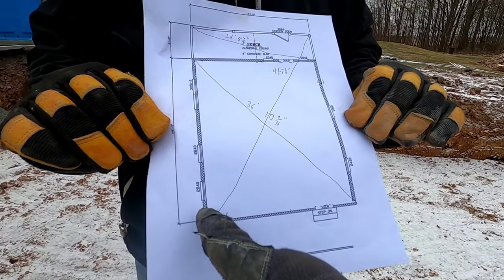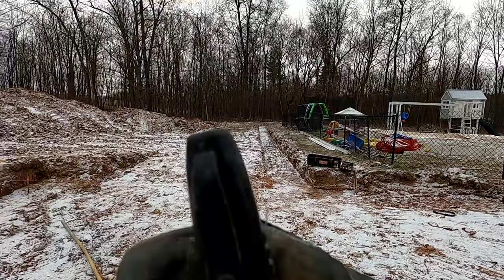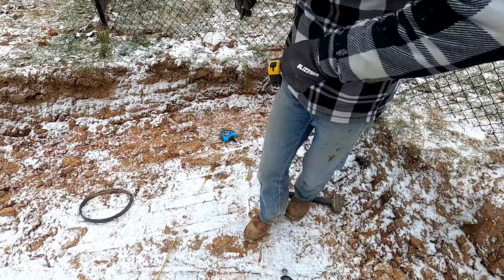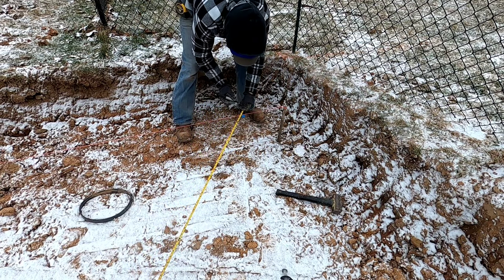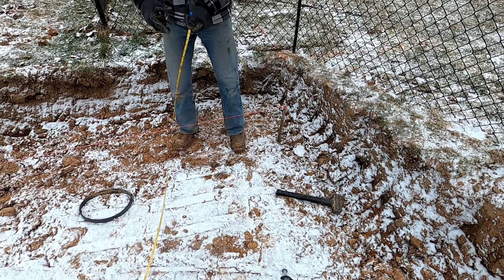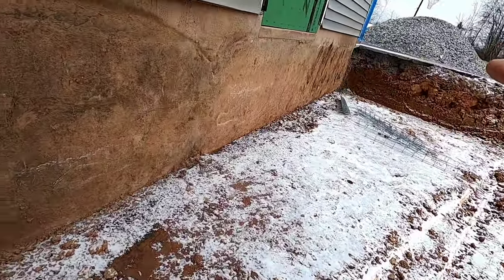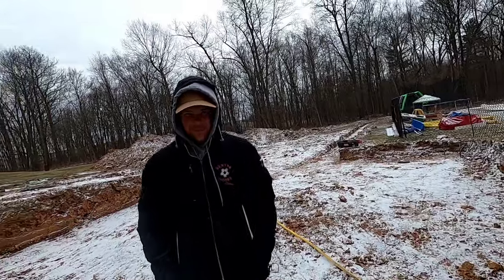Pretty simple — Jake's going to hold me right there, which is that corner, and I'm going to go over to my line over here. Get yourself a marker. I have my cross measurement: 41 foot 7 and 7/16ths, and just mark that right on the string. 41 foot 7 and 7/16ths — right there, I marked it, that's my corner, and I do the same thing on the other side. I got that outside corner established, that outside corner established. I got these stakes right in the corner, same thing over there. I just matched up the corner and now I can pull my string line all the way around and start forming.